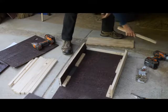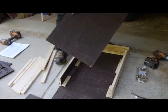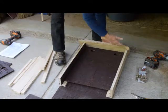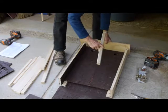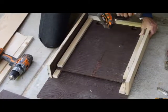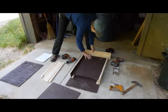Now what we're going to do is attach the partitions. The partitions have little holes that are probably meant as vents, although the bats will probably pass through. We'll put these partitions in using the roof to make sure they're not too high, then put the beveled one next to the roof on the top, and the two sides on like that. Then we'll screw those on — just the same thing for the next partition.